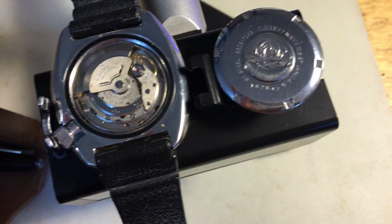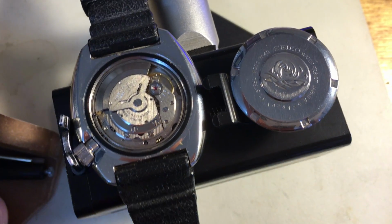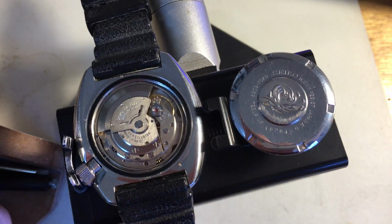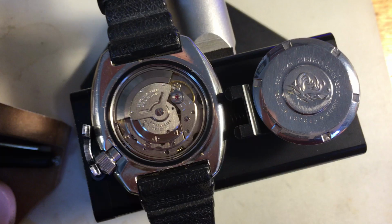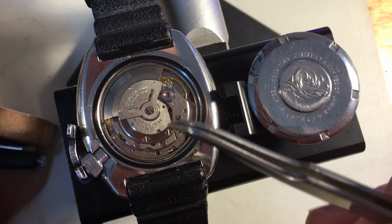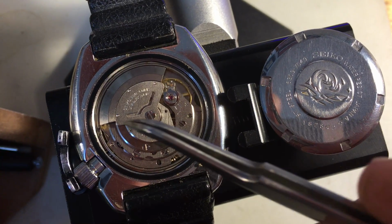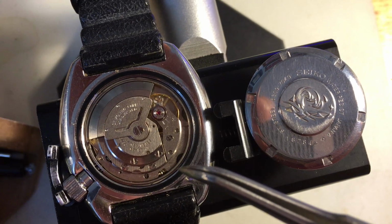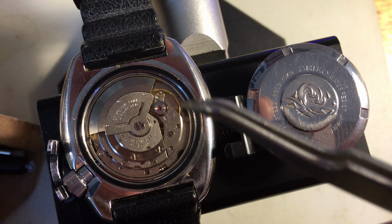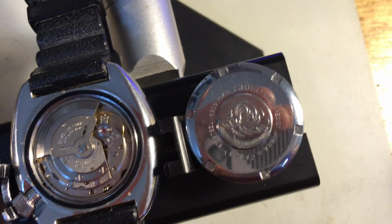Three nice watches. First up is this extremely early non-Suwa. It's basically like the first month, I think, that the non-Suwas were produced. So it's got the higher end non-Suwa movement with the different jeweling that gives me generally better numbers. The movement looks bright. It's a little hazy. There's no flop on the balance. It's okay. Watch is clearly original.